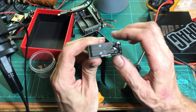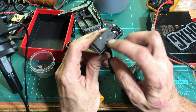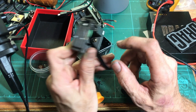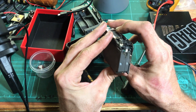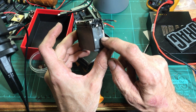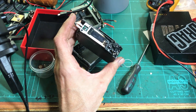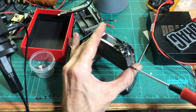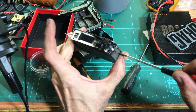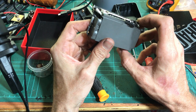It doesn't mean there's a wiring fault necessarily. The two wires still seem fairly well separated — the negative is not jammed up against the positive. That carrier is melted. We'll just pop these wires off and have a look at these contacts under here, pop these screws out. I don't think there's anything shorting out as far as wires coming loose, contacts coming loose, or wires shorting into the case. Don't think that's the issue.